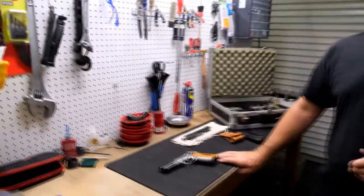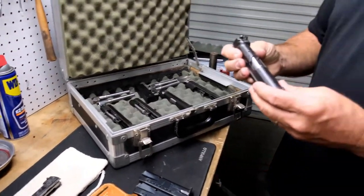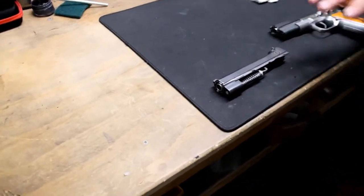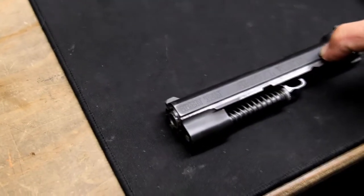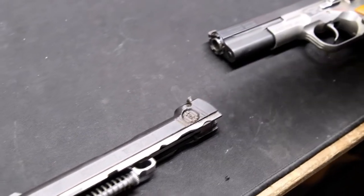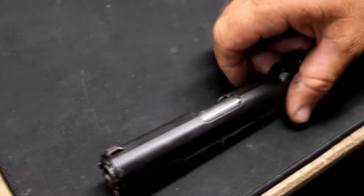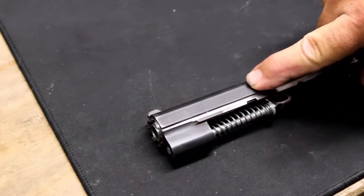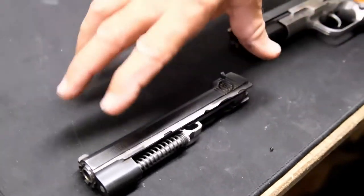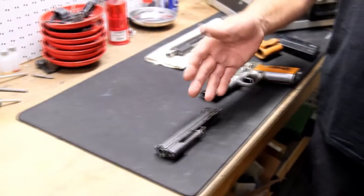Being the R&D guy, I got to play with just about everything. All of the different models we came out with, I have just about one of each — with the exception of the Special Forces Light, which was hard chrome. We made a very short run of them. I had a couple but was really afraid to shoot them because we had issues with porosity in the slides — they would crack and break. The round was so violent that it would actually bow the slide and stress crack it.